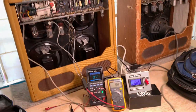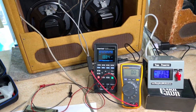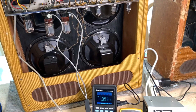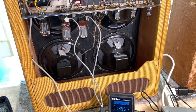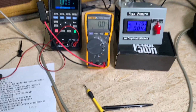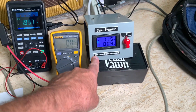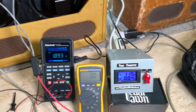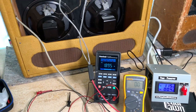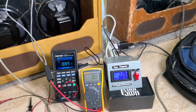That's pretty much the demo - it's a straightforward box, go ahead and get one. Even if you have a modern amp, you'll be able to tell when your amp's starting to act up. The electrolytic B-plus filter caps - when they start to go bad, that amperage on this meter is going to start building up. Once you blow a fuse you could look at this and say it was at three amps. This takes a five amp fuse, so you'll blow the fuse in your amp - usually three amp - before you blow the fuse in this thing.